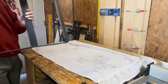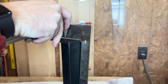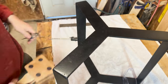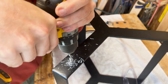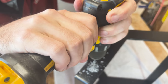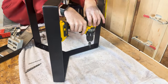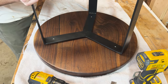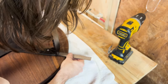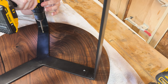When I've done pin legs on coffee tables in the past I add inserts into the wood to allow leg removal for shipping, but since this is just a large single-piece base I decided to screw it directly to the top. I mark out my spots and use a scratch awl to center my drill bit and make my holes. I know it's been a while since my last post — I have five project videos already filmed and I really just need to sit down and edit and upload, hoping to come out every Thursday. I go back with a countersink bit so my screws will sit flush underneath, center the base, pre-drill the holes into the top, and add felt pads between the base and the top to prevent friction, plus on the bottom. After checking with a straight edge to make sure it's perfectly centered, I shoot my painted screws in and it's done.